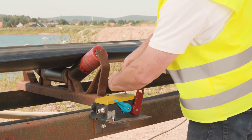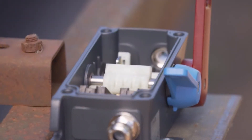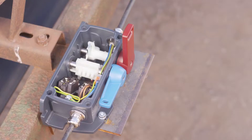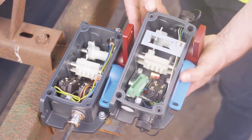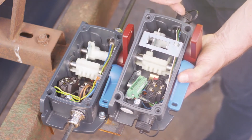Emergency pull wire switches mounted along conveyor belts are often cabled in series — that is exactly what we have here. In this case, we need conventional electrical connectors and two cable entries in the housing. The ZS92S is available with a maximum of four cable entries. Alternatively, there is also a variant ready for connection with the Dupline Safe Module, making the electrical connection a matter of seconds.